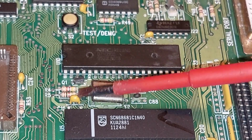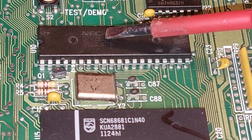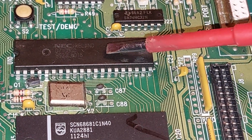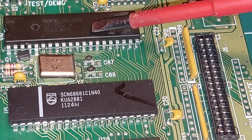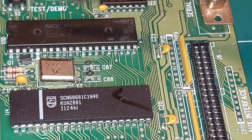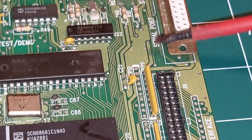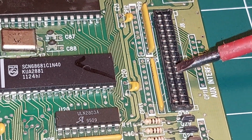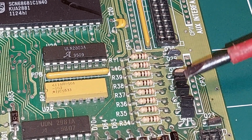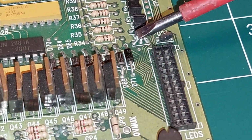Another transistor here, not at all sure. Again, something to reset, possibly. This is a 71055. Yeah. It's an expanded interface chip. It's an interface adapter like a 6821 or an 8255, but a bit bigger, and it looks like a lot of its lines are going down here, so does this have something to do with the alpha display? Another 803 here, but it looks like it's going here, so not sure what that is. Well, keep going.